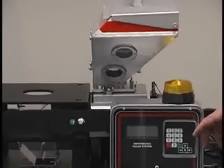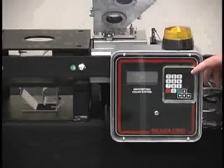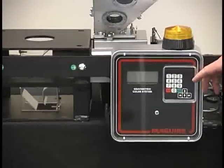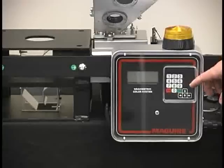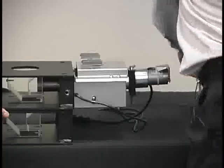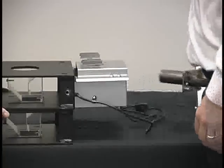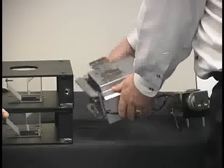Ease of operation: you set the mode of operation — either injection molding or extrusion, cyclical or continuous. You enter the respective shot weight or pounds per hour, set the required letdown rate, and turn the unit to run. It's that simple. With no tools required for removal of the hopper, the load cell assembly, and the metering device, 100% clean-out is achievable.